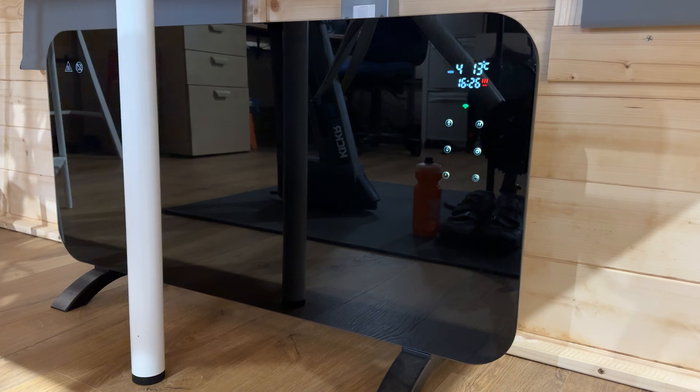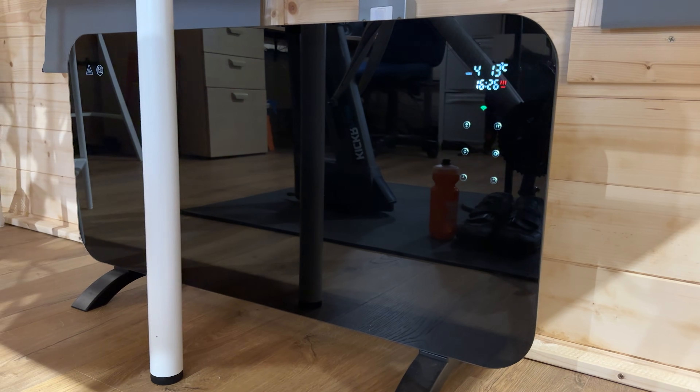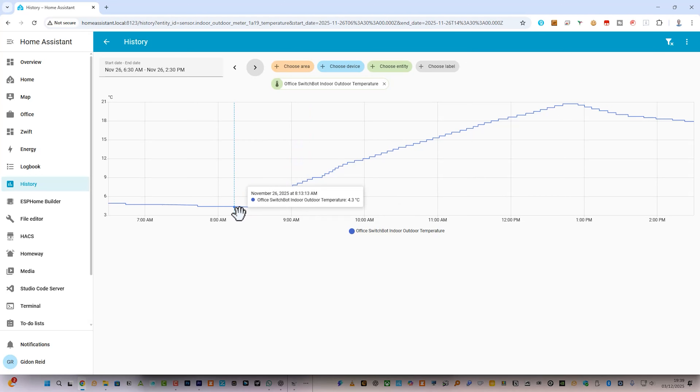I did the same test on another similarly cold day with my 2kW electric panel heater. The outside temperature was minus 0.5°C and my office was 4.3°C. After one hour the temperature in my office was 9°C and after another three hours it got to 19.5°C. The outside temperature was warmer though by this time, at 7.8°C. Considering the diesel heater is meant to be 8kW and my panel heater is 2kW, the diesel heater only performed a little better.